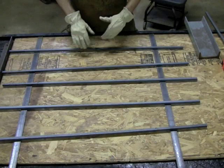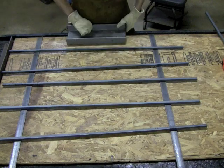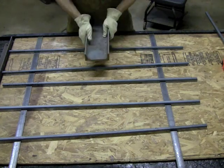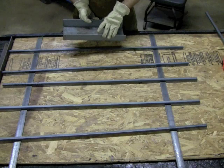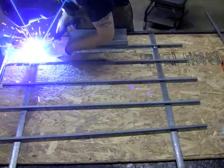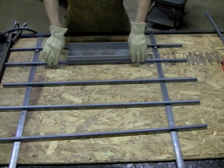To do the spacing, you can pre-cut some 2x4s or anything you have that will leave a 5-inch spacing. I'm lucky enough I have this piece of scrap laying around that just happens to be 5 inches, and I suggest getting a longer piece, because that way you only have to have one piece. If you have a short piece, you're going to need two pieces to put on either end. I like to use just one long piece that's 5 inches wide, and I can just set this on the end and set a picket closer, and I know that's going to stay square. Now that I have my first picket in place and welded on all sides, all I have to do is move up my spacers, push the next picket down against them, and move on down the line, one step at a time.